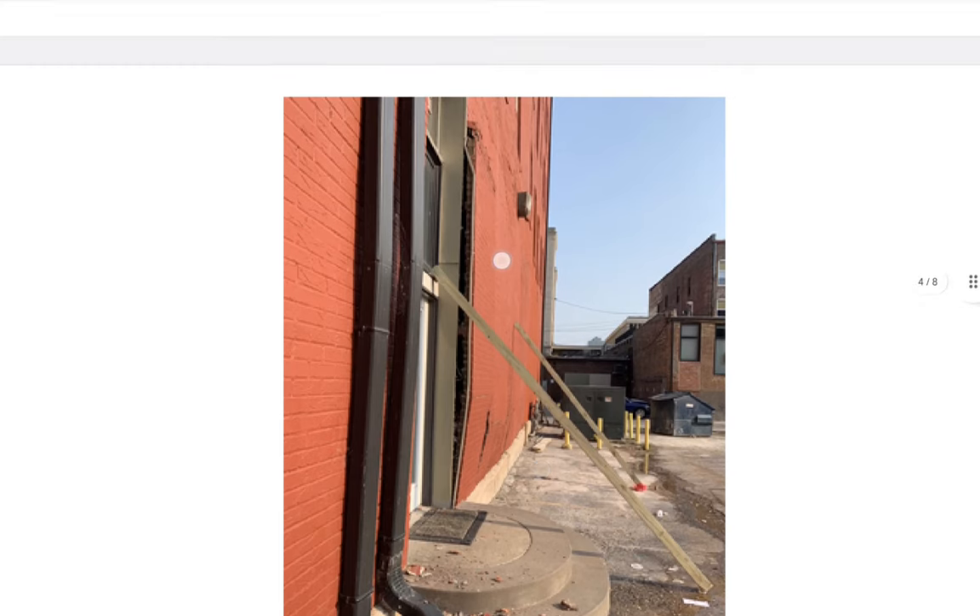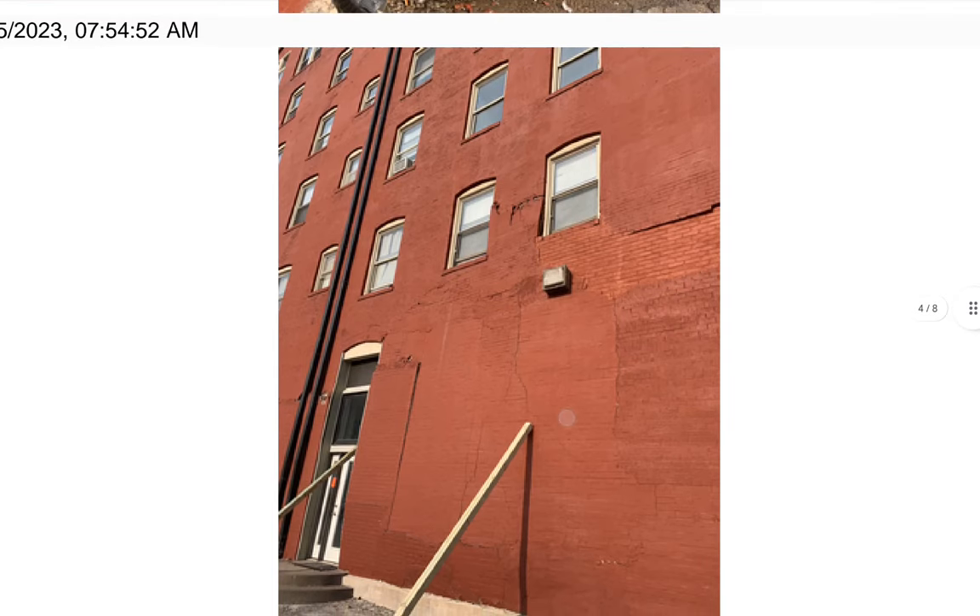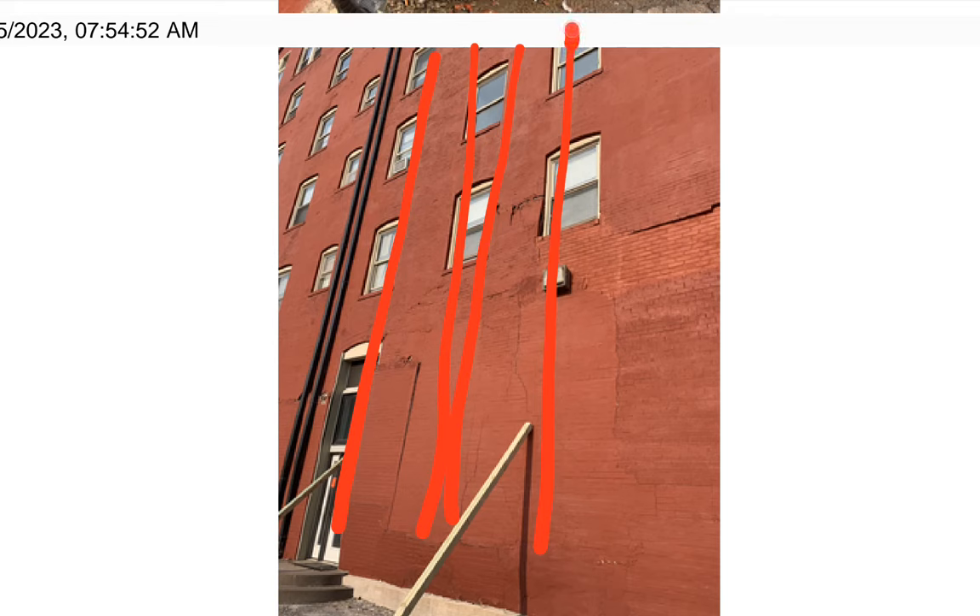Cold joints — all cold joints, no tying in, cold joints, not connected. Just butted up, no overlap, nothing tying together — creating these multiple columns that aren't going across each other. On the face at least, these are showing buckling and deflection. This is 7:54 a.m. on May 25th — he takes a photograph of the structure. Looking at the doorway I mentioned, the brickwork is now buckling out — there's rotation at that point. It's taking a load because he just infilled that panel. There are multiple columns here because the veneer is no longer tied back — six-story columns buckling.